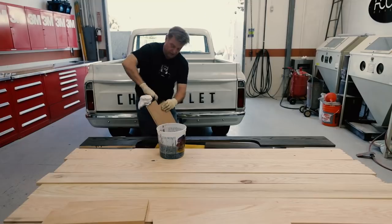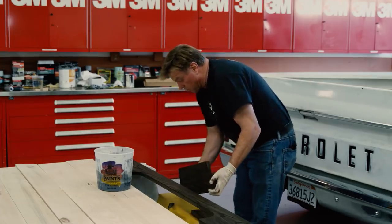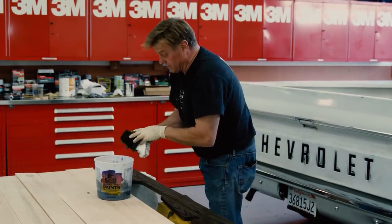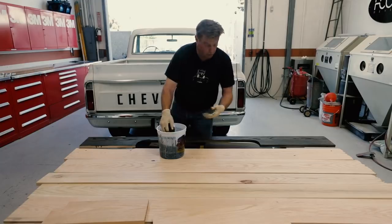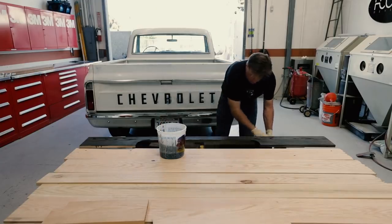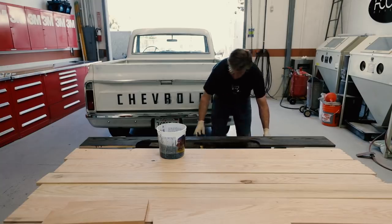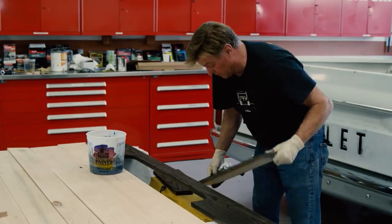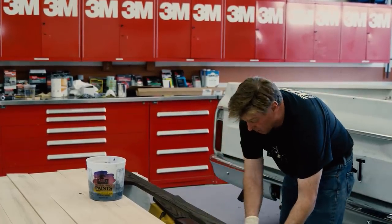If I were to use an oil-based stain, it takes about 8 to 24 hours to dry before you can put a surface coat on it. One of the things I like to do is use an oil over the top rather than putting a clear on. When you clear the wood, you have to keep it perfectly cleared and you can't get any breaks in that clear, because if the wood starts to absorb any moisture, that clear will start peeling off. Rather than just adding more oil to the wood when it looks dry, you'd have to pull the wood out and resurface it again. So by using just an oil, it's going to last a lot longer.